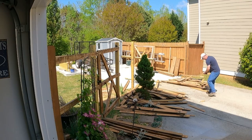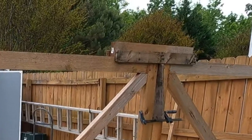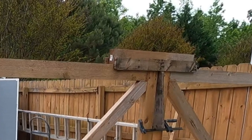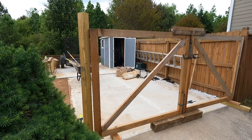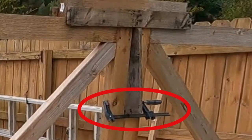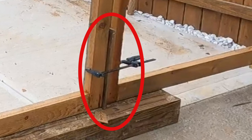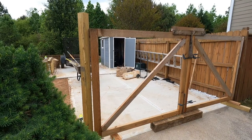I'm also taking apart the existing gates. I apologize — I'm not sure what happened to the footage of me hanging these gates. But you can see here I've made a little bracket at the top to hold the two gates together in line. My driveway is extremely level, so I stacked up both left and right gates on equal blocks at the bottom, clamped them together in the center using a three-quarter inch piece of wood between the gates for a three-quarter inch reveal, put the gates in place, made sure they were square in the hole between the posts and level, and then attached the hinges.